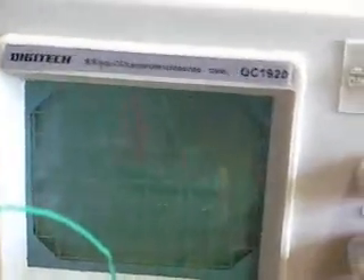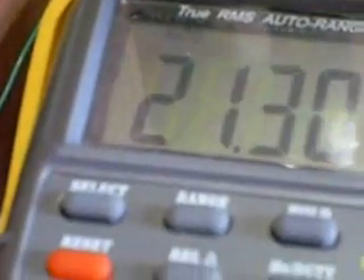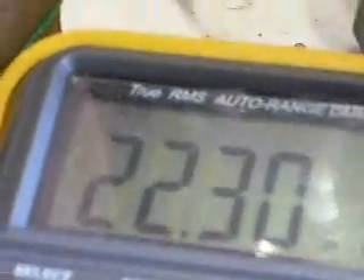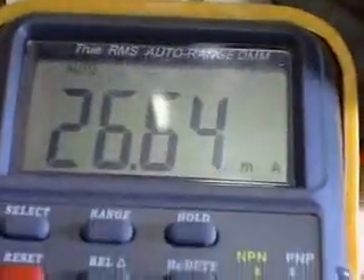You can see the waveform back there. I'll just move the reed switch a tiny bit. Back that way - up to 20 mA, not too hard there. There's a fine line; you've got to get to the lowest amp draw. Still, it's a pretty efficient motor. It's not doing the strongest torque - stick a finger up here and you can slow it down. You can see the amp draw increases when it's slowing.